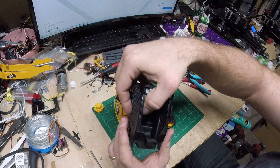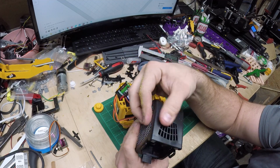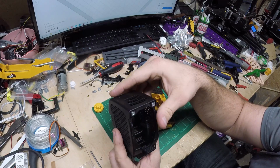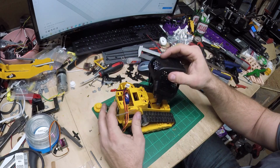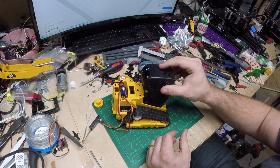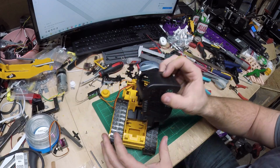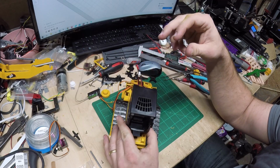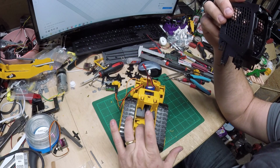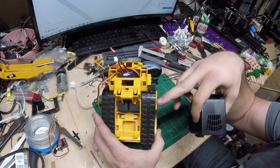I didn't mention earlier in the teardown portion, but we will add an LED in each one of those. We'll just add 2 simple white LEDs. This doesn't come with the little amber lens on top. If it did, we'd put a couple blinking LEDs in that. But right now, if I wanted to put this cab on, all I got to do is trim these tabs off. That's the only thing really in the way of it going in. Well, I do have these screws sticking out, so I'm going to have to trim this back a little bit for the screws, but we'll still have a couple holder clips to hold that in. And actually, I might cut this cavity out and put the battery right underneath there so that you can take the cab off to get to the battery. So I haven't quite determined that. In the final wrap-up video, we'll show all that.